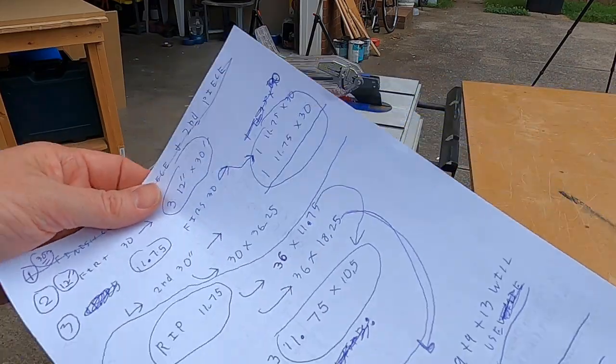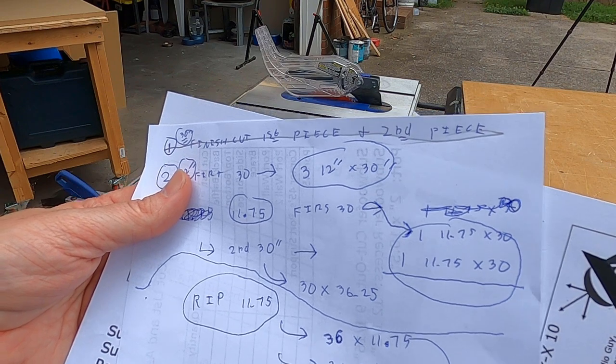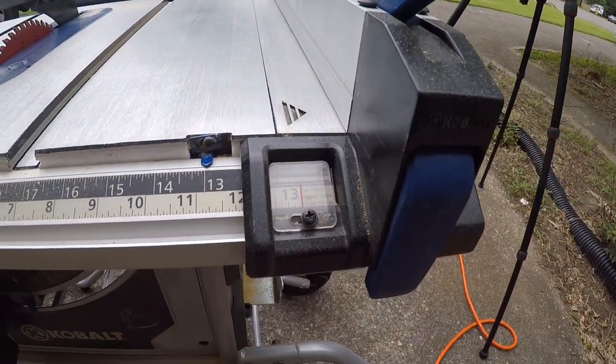During the design process I usually make a cut list and jot down some notes by hand on how I want to plan out my cuts. My goal is to minimize the number of times I move the saw — every time I make a cut of a certain dimension I set the saw for that cut, make all those cuts at the same time, then reset for the next series. This gives a better overall fit and minimizes gaps and air leaks in the enclosure.